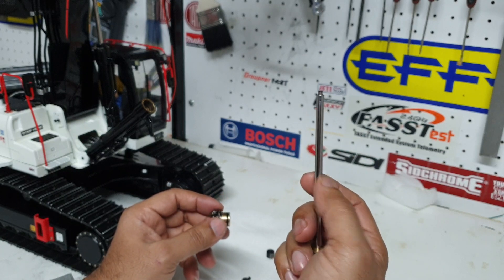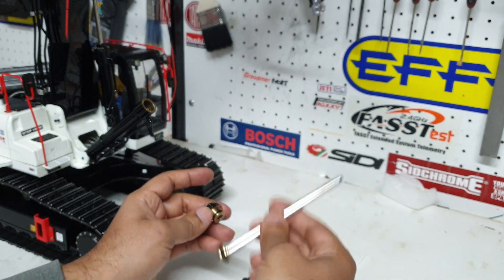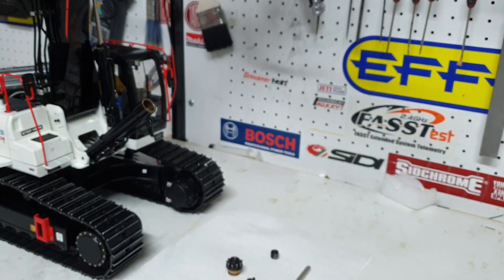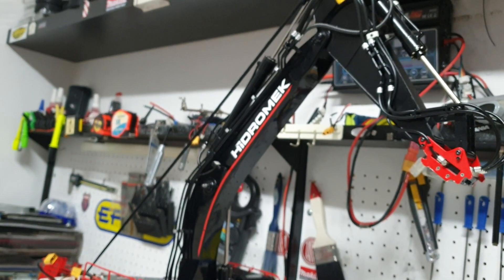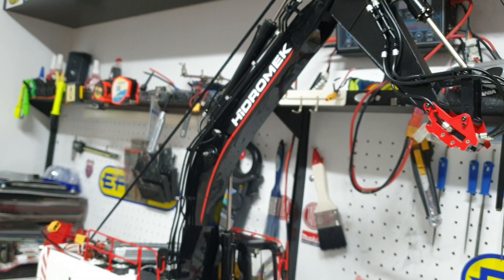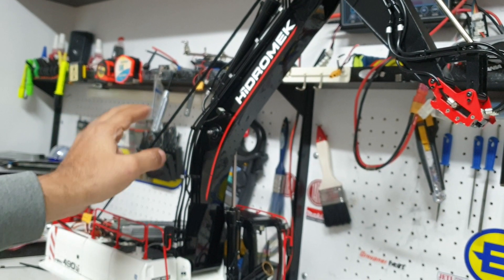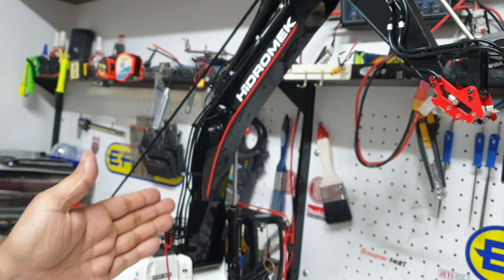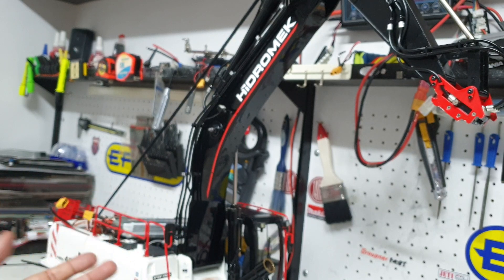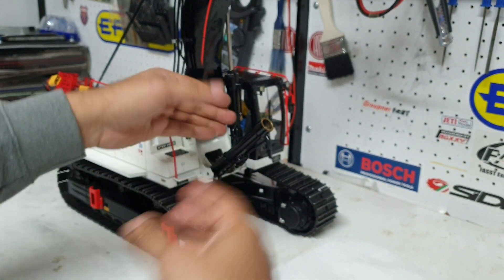But if you've got any swirl marks or scars and scratches on this cylinder, obviously it's going to leak. The simple trick is that, firstly, you want to secure your boom. I've used a soft cord to actually secure the boom in place up here. What that does is you can freely work on the cylinder in a more comfortable position. You don't even need to take the bottom pins out — you can just take the cylinder out.